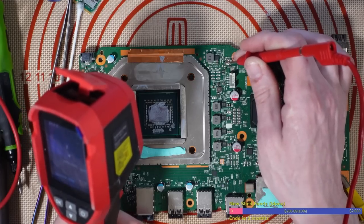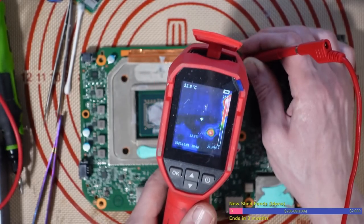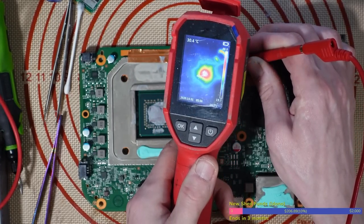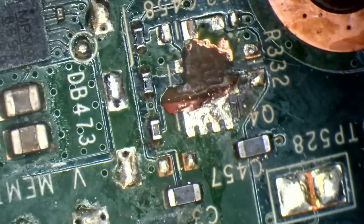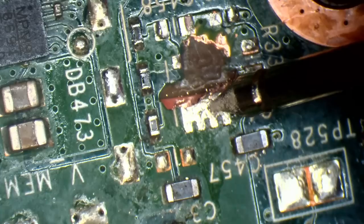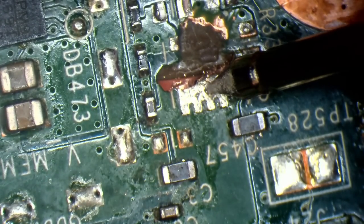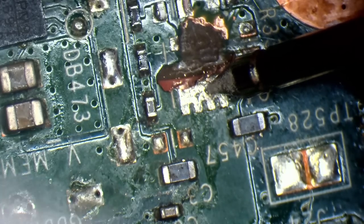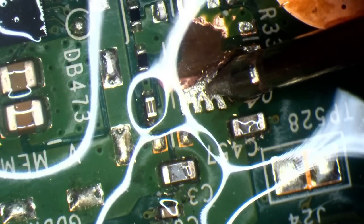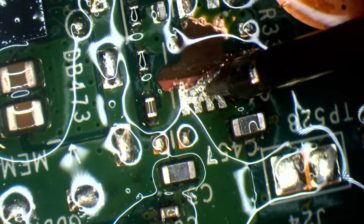What is shorting? It appears it's something here. It looks very close to where my probe is. I don't like the look of that cap on C3. Rather than using the thermal camera, because it looks so close to the probe, I can use a little bit of isopropyl alcohol. Whatever gets hot is going to cause the IPA to evaporate. And yeah — that cap doesn't look good.